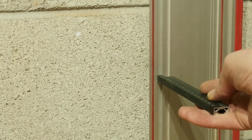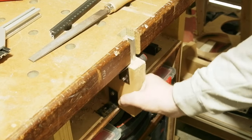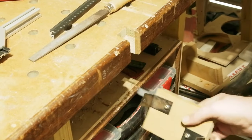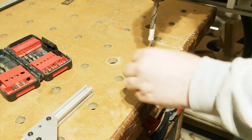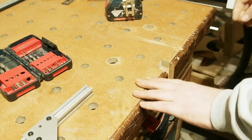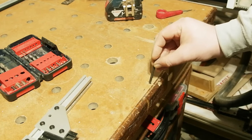That's ideal — fits but with zero play. Out with the old pin, in with the new. To fix the new one to the bench, I do a through hole either side of the cutaway in the front. These I counter-bore with a large bit to sink the bolt heads. The through bolts will have these flat sliding T-nuts on the end, onto which I can simply slide the new mount for the pin.